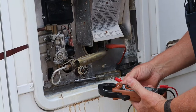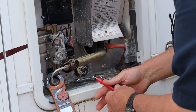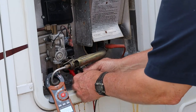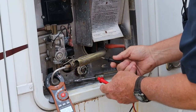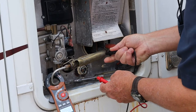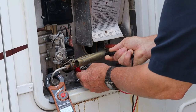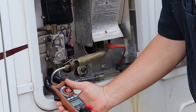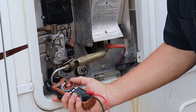Let's see if we got any power here. I'm just going to go across the element — hang that meter right there. No, we have no power. So let's check the ground; the burner tube should be a ground. We have no power, so we've lost our power somewhere. Now we've got to go chasing that to see why we don't have any power.